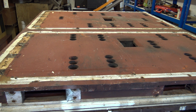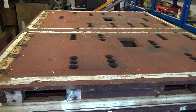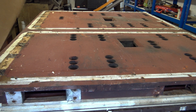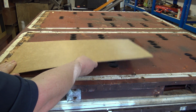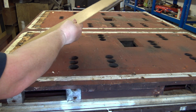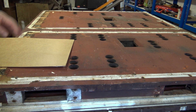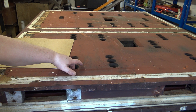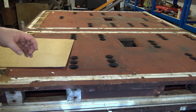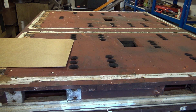What we've got to do is board over these holes. I'll just demonstrate with a piece of hardboard — imagine you've got another bellows section which is all leathered, hinged at this end. By opening and closing — one on the upstroke, one on the downstroke — you're forcing air through these holes, which fills the bellows up. There are some non-return valves which are pieces of leather with straps or springs. We haven't been inside — in fact this is a non-panelled bellows.